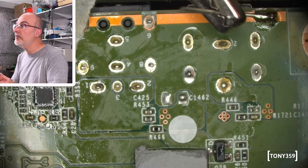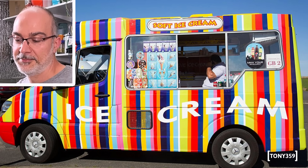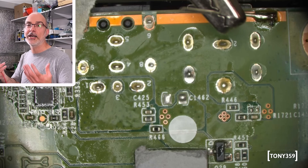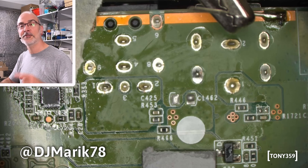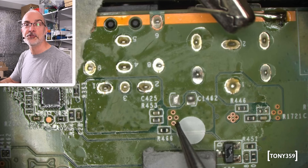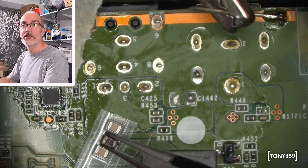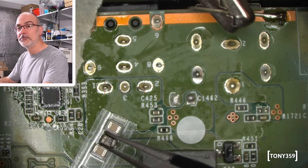Is it like a smoothing capacitor? So it's either a smoothing capacitor, or maybe it's there just to absorb some spikes or noise or whatever. Having spoken with my expert DJ Mark 78 — link is down below in the description — he thinks these might be a 100 nF capacitor, which is usually used as a filter on the supply stage. And it also happens to be basically the only one I have, because this is exactly the same size and also rated for 100 volts, which is plenty. So let's install it.